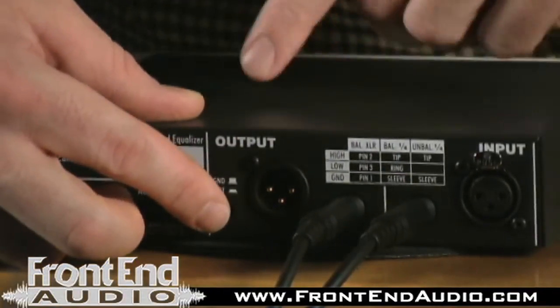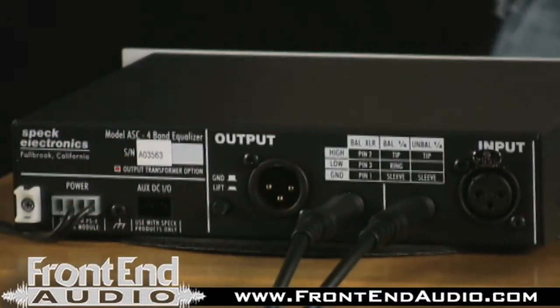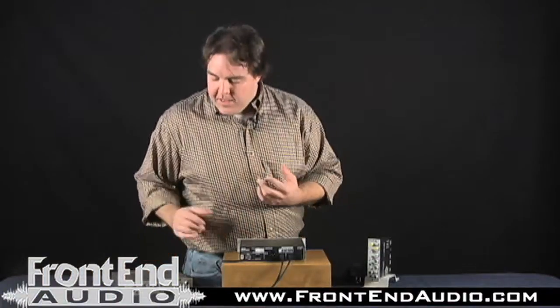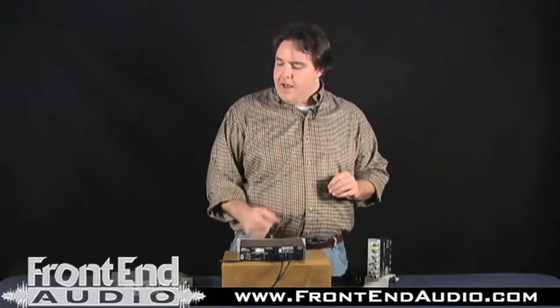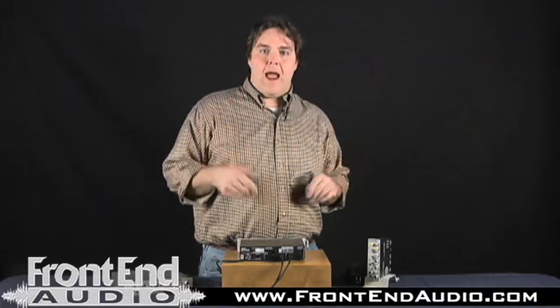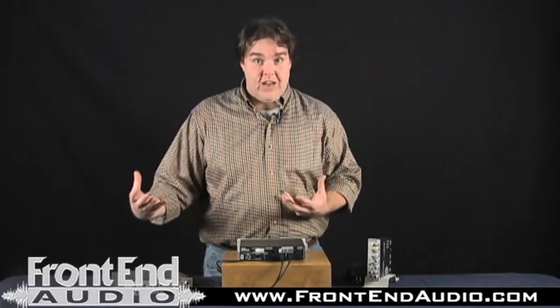You do have a ground lift as well, and then basically you have the 2 different power supply options for the rack mount unit. And in the video for the Mic Pre 5.0, discuss how you can power up the EQ from the Mic Pre 5.0 whenever you use them together, so that you only have one power cable in the rack for powering 2 pieces of gear. So it really does turn this into a very functional channel strip.